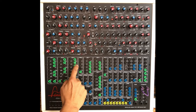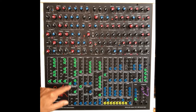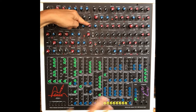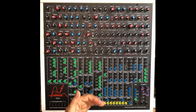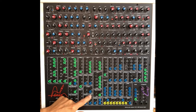Here there is a small error on the panel — it's not a triangle wave coming out here, it's a sine wave. So you have a ring modulator, you have noise output — analog and digital. With digital you can adjust the timbre, which changes the clock of the digital noise. And the wave multiplier is kind of tricky — I use it more as a clock divider than a wave multiplier. You have sample and hold, a simple one but effective, and you also have noise output that you can send in for really random sample and hold signals.